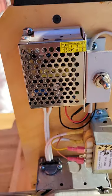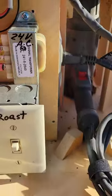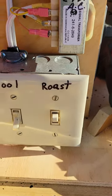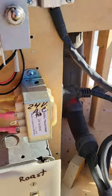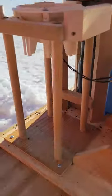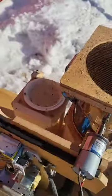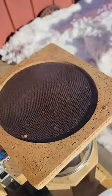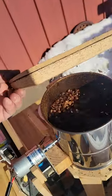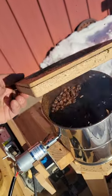I've got that gearbox hooked into a 12-volt DC converter, and then it goes down into my roasting switch. The other one is for the cooling, and that has a 24-volt AC transformer running that little fan. It works nice because it will also blow the chaff off the coffee. That's another reason I like to air roast versus pan roast — you get rid of that chaff.